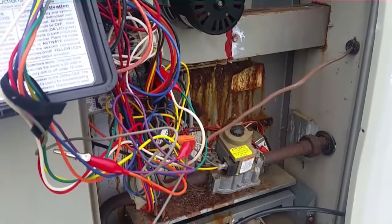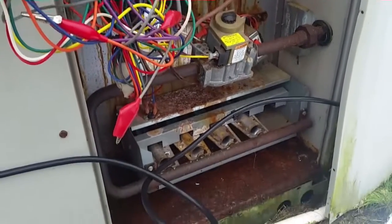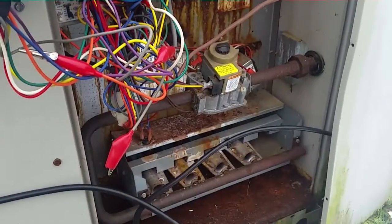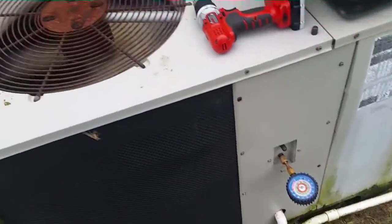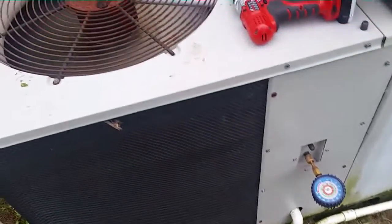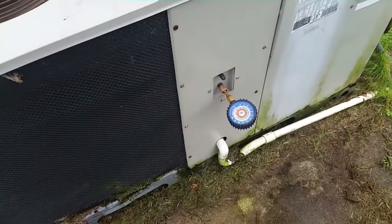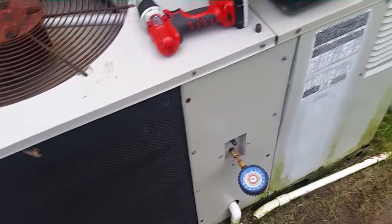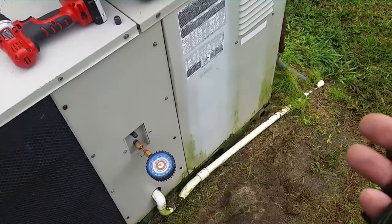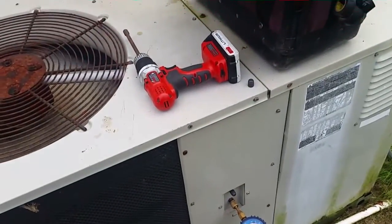You can see what the story is here — it's a nasty old unit. The heat exchanger doesn't leak as far as I can tell with the oxygen test and visual inspection, but it's one of those things where it could be any day. It could just rupture right in half on one of those seams, so I don't think it's worth it. We'll see if the customer thinks it's worth it. I'll switch it to AC just to make sure everything is working — it should be since it's been cooling this summer. Suction pressure above 75. The drain was a little stopped up so I had to vacuum it out — it flooded the interior compartments. Just a nasty machine in the gas area. Nothing's technically failed as far as the heat exchanger, but there is a lot of concern going forward. I think it's worth replacing — some others may not. I'll propose it; maybe I'll get shot down.